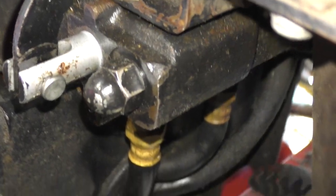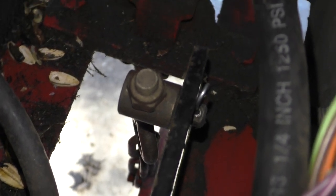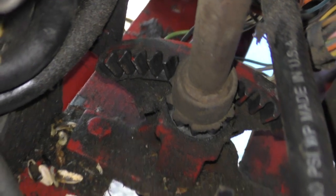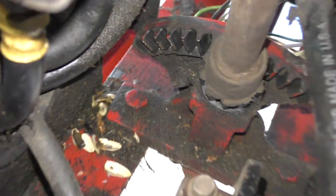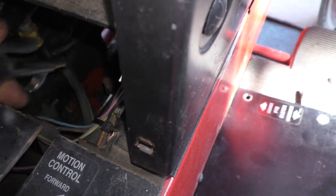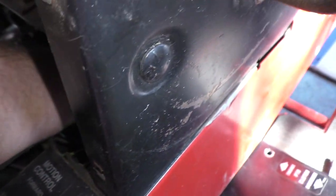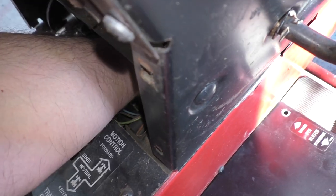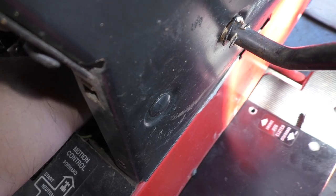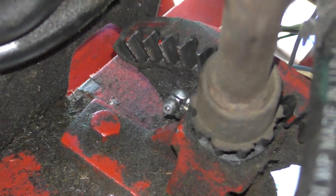I remembered — I'm going to take this panel off. There's our valve. Looks like we had a visitor. Here's our trunnion that we just hooked up our chain to, and there's our steering gear. What you can't see is to the left, right there, should be our grease fitting. Let me blast that out and see what it looks like. Hand in there. Feels like a grease fitting — feels like a loose grease fitting too. It's a real tight fit. There she is. We're going to put our fitting on there and load that up with grease.